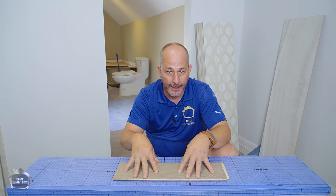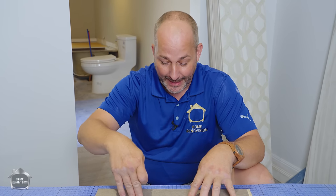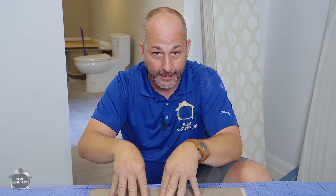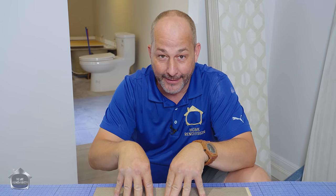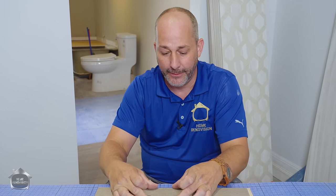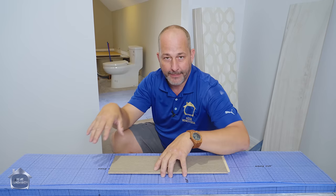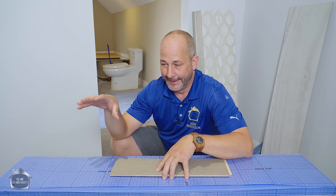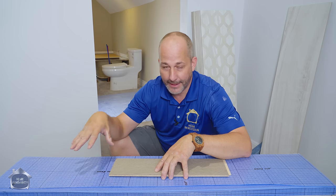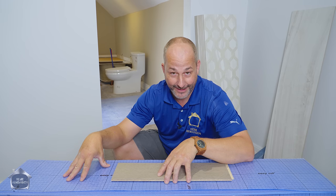Here are some of the most popular questions I get. Can I install flooring and then put kitchen cabinets on top? The answer is yes. This product is rated for 65 pounds per square inch. That means I can put more weight on this floating floor than on car tires, which are only at 35 PSI. If a car with four tires can support the engine block, this flooring can support your kitchen counters even with natural stone countertops. One benefit over three millimeter EVA: the EVA stinks. This has no VOC — it's not toxic at all, so when you put it down you won't have to deal with fumes.